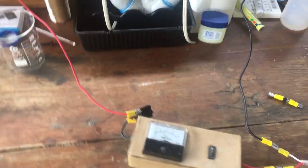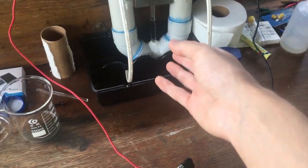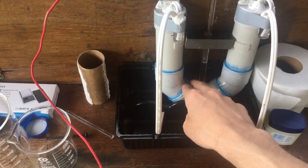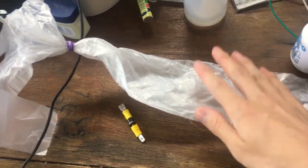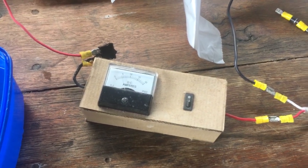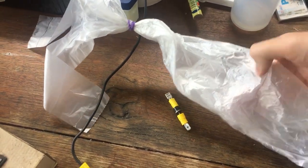Now I think we need to fill this up with some cold water just to act as a cooling buffer, because 75 watts through the cell is quite a bit of heating happening to that water — and yeah, it's already getting quite hot. I'm just going to fill up this container with some water to keep this cell running. The final thing to do — I've got this plastic bag hooked onto the hydrogen side. Hopefully if we leave this going long enough, we've got it running at a rate of about one and a half to maybe even two litres per hour of hydrogen gas being generated.